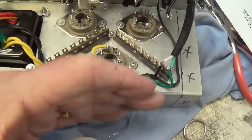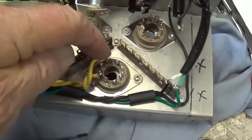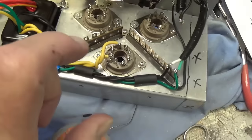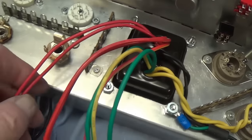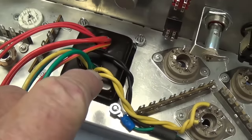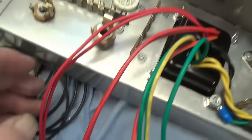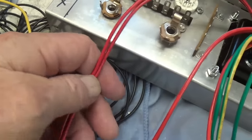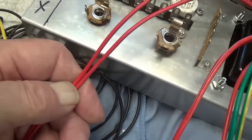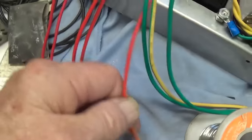The B-plus from pin 2 right here will go through the grommet and then to our electrolytic filter caps which will be on that plate once it's installed. Now it's time to wire the high voltage winding of our power transformer to the plates of the 5Y3 rectifier. This transformer has a rather unique feature in that it has two separate high voltage outputs. The red wires will output 325 volts. The red and white wires will output 275 volts. The red and yellow wire is the center tap.